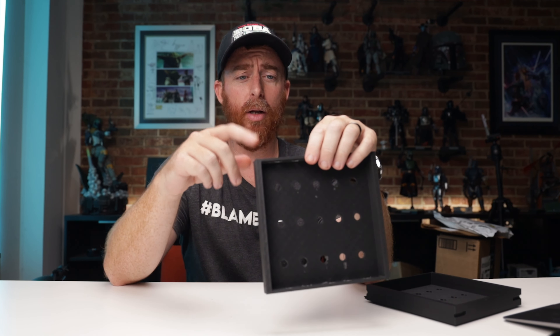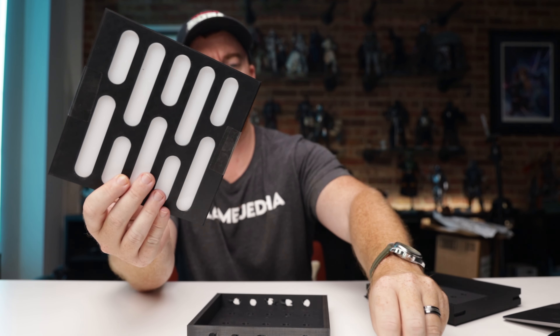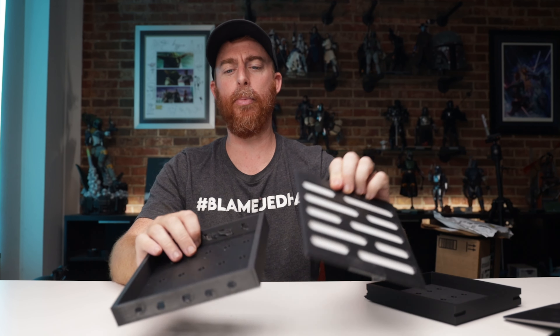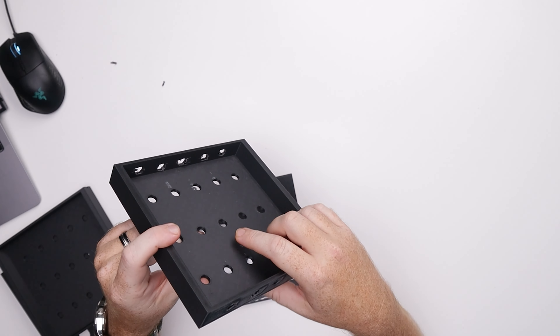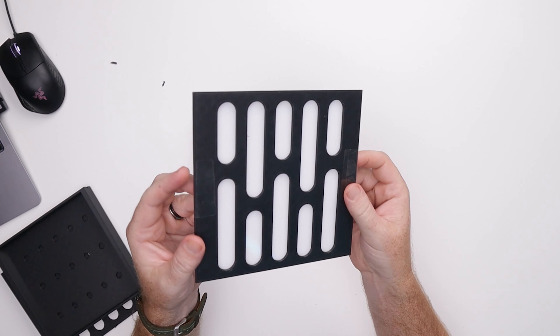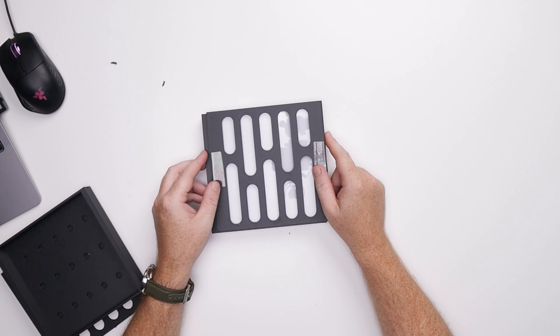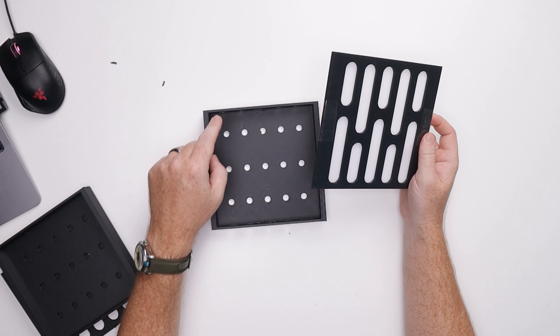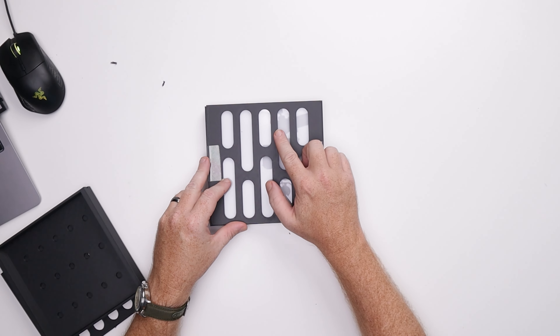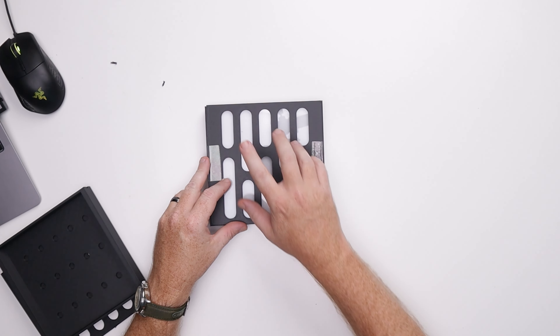After drilling and testing some LED strips through the holes, running them up and down, I ran into another problem: you want the lighting strip at a certain distance from the acrylic or you'll get hot spots or it'll be too dim. If the strip was connected to the bottom of the plate it was too far away for a good clean light. And some of the lighting alignment was hit and miss — one area would be lined up nicely but then veer off elsewhere. It didn't look all that great.